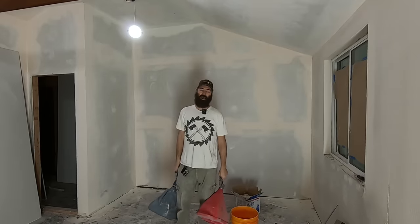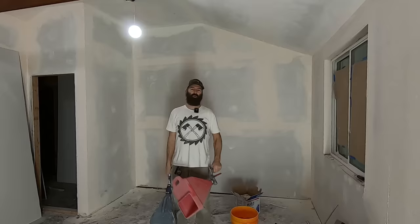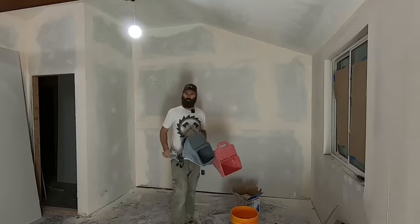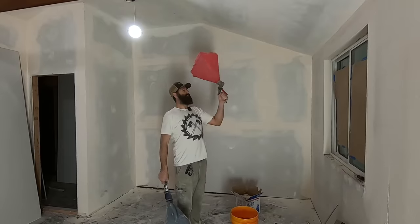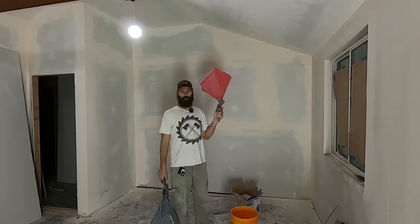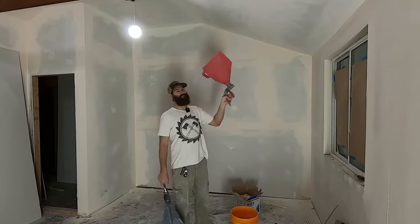You use these for remodels mostly. Now if you were gonna do an entire house, you're best off hiring a drywall company that will pull up with a texture truck, or you can possibly rent a bigger machine — you push it around like a shopping cart, fill it up with your texture and spray it on the ceiling. All the methods involve a human being spraying and manipulating a device to get it to stick to the ceiling.